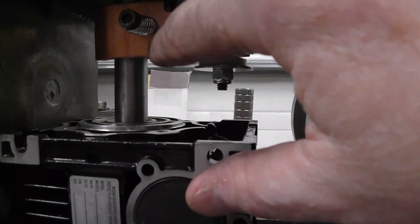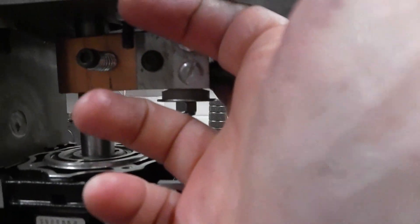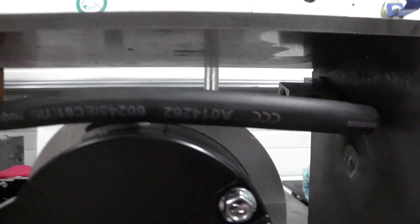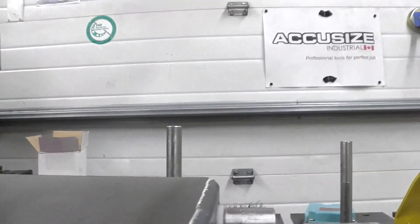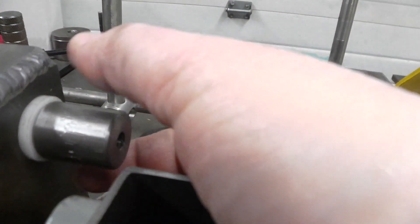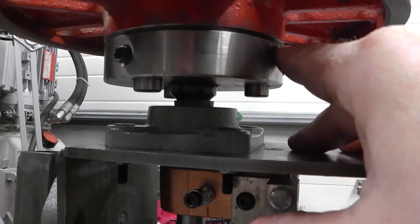Here I've got the grounding clamp and I've got two plugs. I need to get another bracket like this to go on the opposite side so it gives me 100% contact onto the shaft. The welding wire is hooked up to a terminal block and it gets connected to this little plug here — you just clamp the ground clamp onto that. It works pretty good because when I welded the bottom part of the adapter it worked out really well.